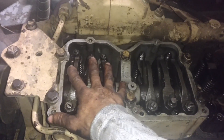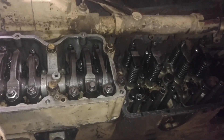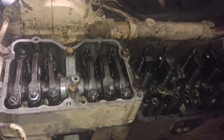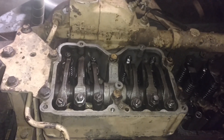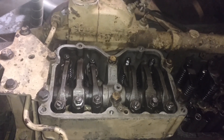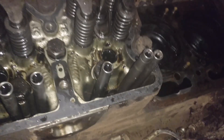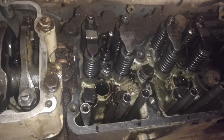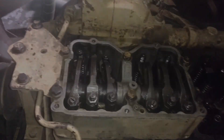I hope I haven't given too much information to confuse everyone. Any questions, just leave a comment and I'll do the best I can to answer. I work on a lot of these older Cummins and newer Cummins. You don't hardly ever see an inner base circle method — I don't think I've run one on anything newer than a Big Cam. All these old 220s and 290s were inner base circle method, but on an N14 you're going to run outer base circle method. Thanks for watching.